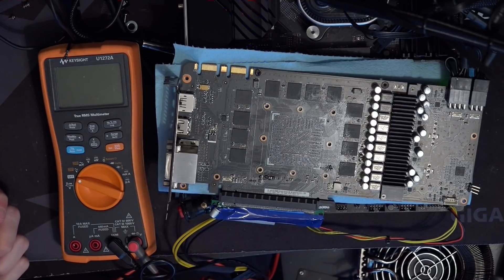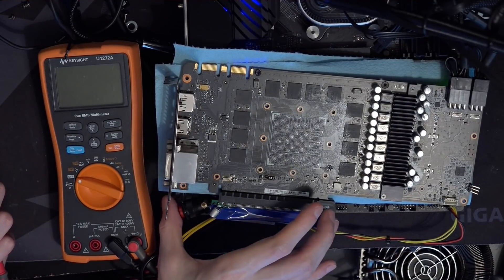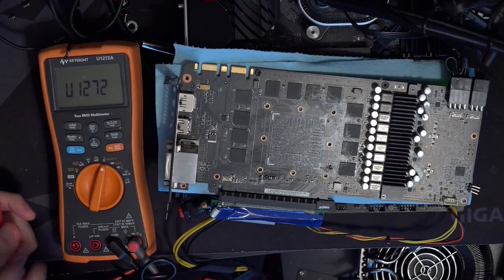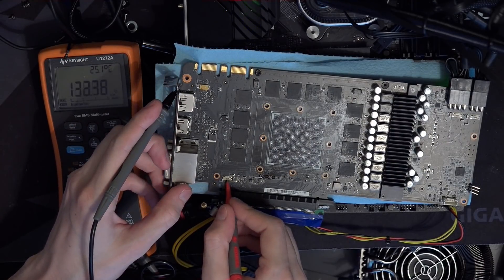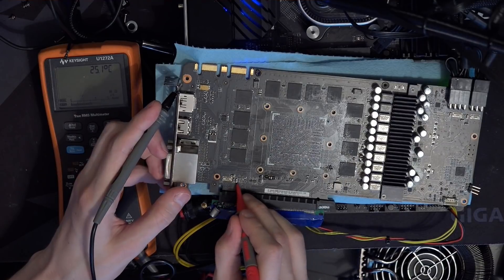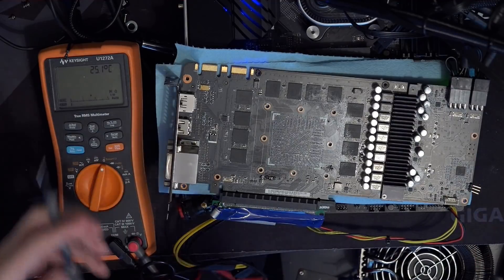I got the card to run temporarily and then it would just die again, so I figured I'd steal the core. I also just collect cores because cores are cool, and removing it makes it possible to basically just turn the VRM on by itself. Before we do that, we're going to do a basic pre-flight check — check that there's no short circuits. As fun as fire is to look at, I don't feel like dealing with fire right now. That's probably 3.3 volts over there. That's fine. Yeah, okay, we can start this up.